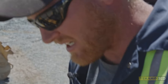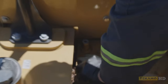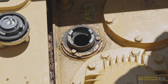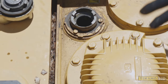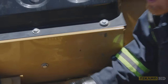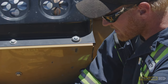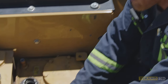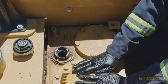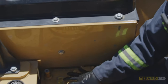This is the top of a hydraulic tank. We want to make sure that we vent the hydraulic tank by removing the fill cap. Once the fill cap is removed, we know that there's no pressure on the hydraulic tank. Now you have two separate canisters here — one is for your hydraulic filter and one is for another screen that's inside. If you remove the filter before you vent the hydraulic tank, you will have an oily mess. It'll come out everywhere — there's no way to stop it because the tank is under pressure.